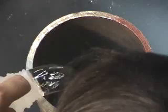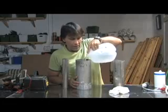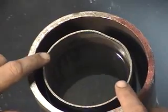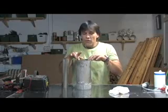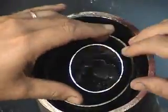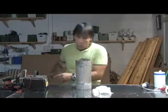Our tap water has a lot of iron in it so it is naturally pretty conductive all by itself. We're going to pour regular water in there, fill it about halfway up, and add our neutral plate — this one does not have a current. These can't touch, by the way — that's not a good thing. Eventually you want to put rubber spacers in here to make sure they don't. For right now we can pretty much balance them so they don't bang together.